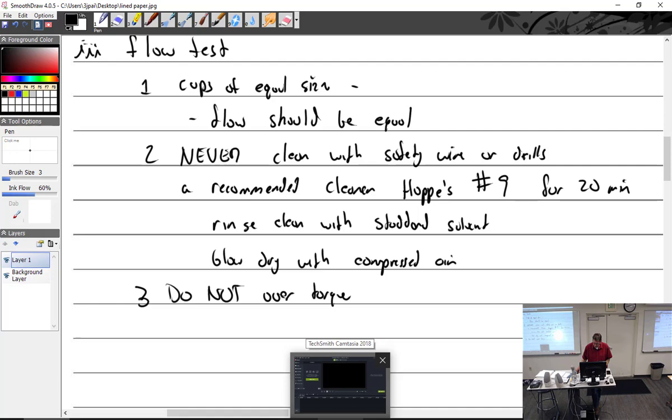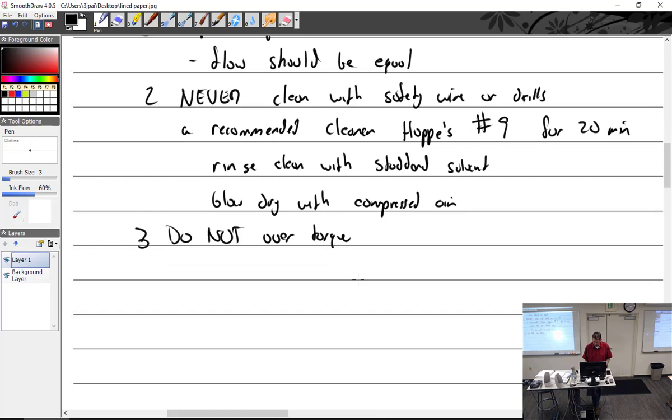Let's see, torque. Oh yeah, torque. I'll write this down. Is 20 to 25 inch pounds. Hang on, I think that's primer line. I mean, I want to write that. Let me see. Yeah, I was correct before. Nozzle body, according to this video, is going to be 40 to 60 inch pounds. It is an 1/8 inch pipe thread, but don't do it for the 1/8 inch pipe thread. You're going to look for nozzle body torque. It's very specific, 40 to 60 inch pounds.